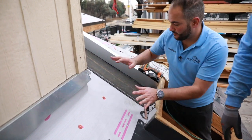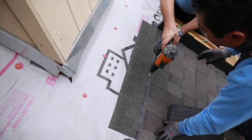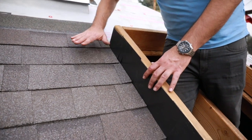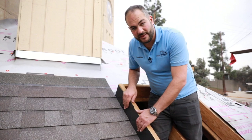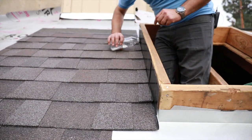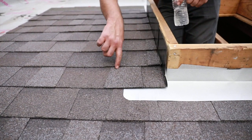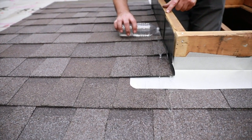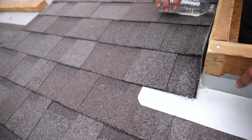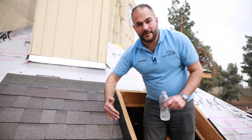That's our last piece of step flashing. We're going to install one more shingle here and then show you how to install the saddle. We've finished the step flashing on this side — you can see we've got our shingles and our step flashing. We still need to install a piece of counter flashing on top. Now, I want to show you how water acts when we pour it down here. During a rain, as water comes along, it's going to constantly come off and roll off each one, so it has no chance of getting underneath each shingle. You can see this lip helps water from coming in here — my fingers here are completely dry. That's the reason we install step flashing here as opposed to a long piece of L-metal: to allow the water to constantly come off and step onto the shingle below.